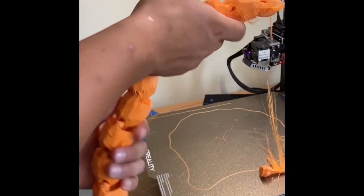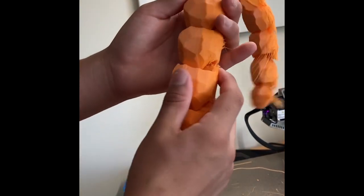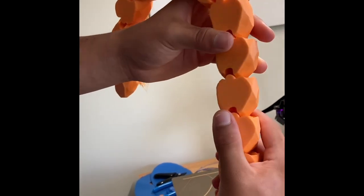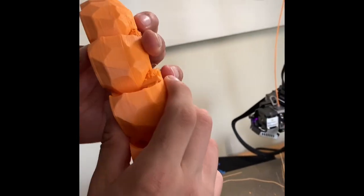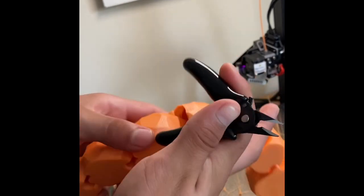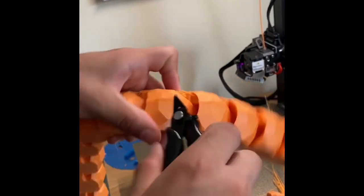So there's a lot of just cutting this stuff off. You probably want to get an allen key or a screwdriver to go through the middle and poke something all the way down any of the holes where there should be spaces. You should be able to see the space through to the bed. There's a lot of filament right here, so I'm going to take a snipper, unlock it, and cut away all this extra stuff that doesn't need to be here.